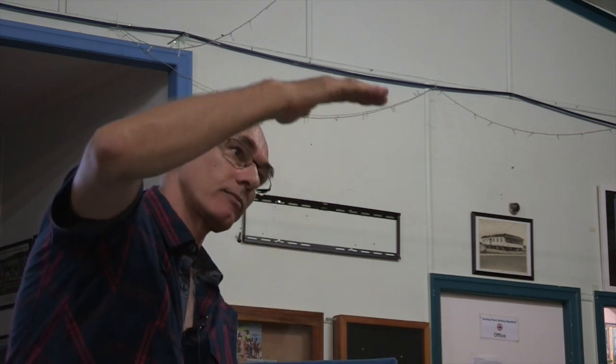Forget about the electrostatic bit that attracts it, but up on the drum is its melting point. And the toner gets attracted to that point and then melts on the paper. That's why it comes out hot. So what happens is you have a tray of aluminium dust, and a wiper comes across and squares it off. And then the laser melts that layer, and then a wiper comes across and adds 0.1 millimetres of more dust, and then melts the next layer, and it just builds it up. It's called laser sintering.